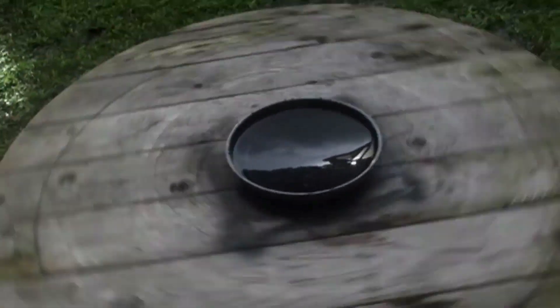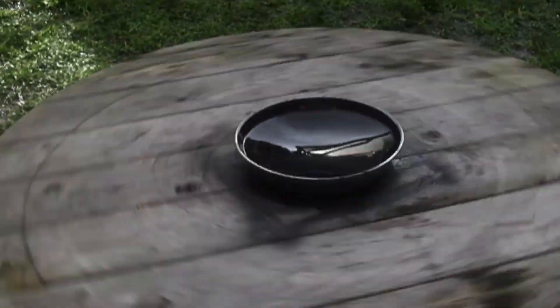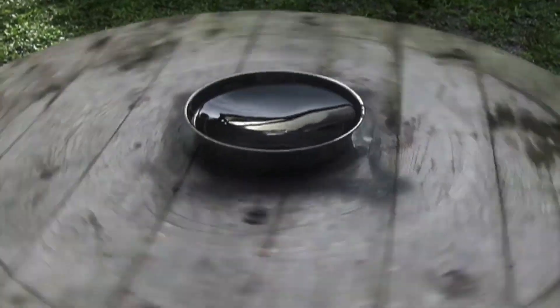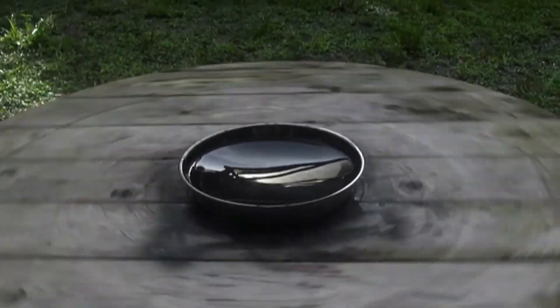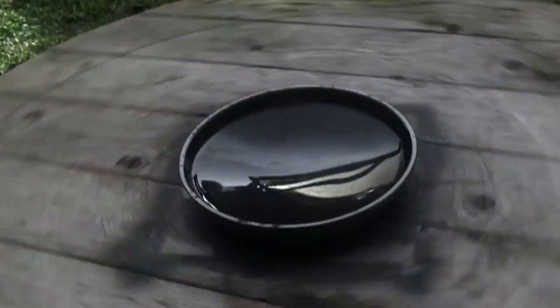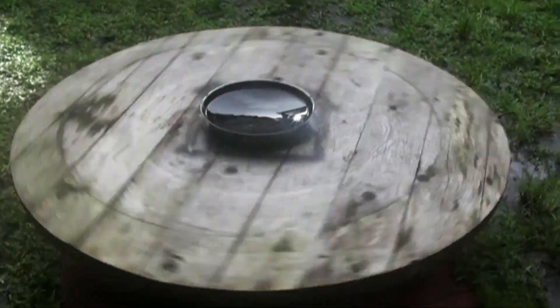This is one way that parabolic mirrors are made. Very large mirrors for telescopes use borosilicate glass or different types of quartz — they melt it and slowly turn it, which allows a perfect parabola to form. Then the glass is allowed to cool slowly and the parabolic shape is locked into place. You can also use resins to do this. In future videos I'm going to be experimenting with that. There's a certain way the resin has to cure evenly, but it makes a very nice parabolic shape.